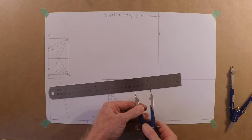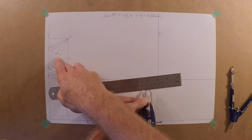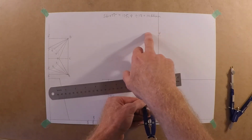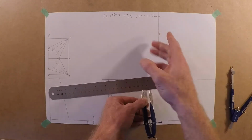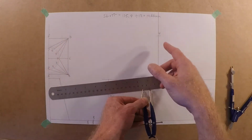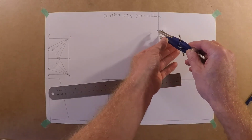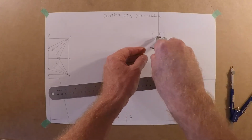Okay. And again, that would be on the curve, right? So if we came over the 14.66, the curve will actually measure out a little longer, right? So just something to think about there as we're compounding, or how accurate you are coming over. So if we did shorten that up, maybe 0.5, I mean, it's pretty difficult. We're just using these dividers. They're not the most accurate. Obviously, we're not on a computer here. But we can check at the end. We can adjust at the end.